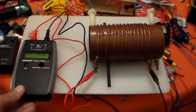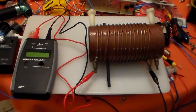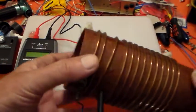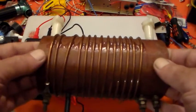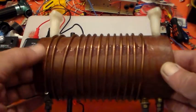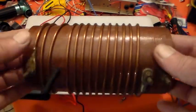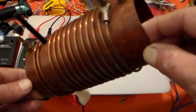So as it is, I can't use it. What I'll have to do is rewind that, take the shorted turn out, and just have a standard tap coil on it. So the windings will be closer together and I'll use thicker wire. But that former is absolutely spot on - it'll probably go from end to end. I'll show you the finished coil when it's wound up.